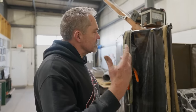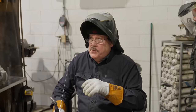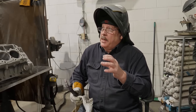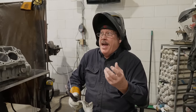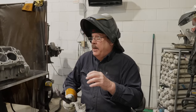It sounds like there's a lot more air going. Or is that the gas? No, that's the shielding gas. The shielding gas is causing the noise difference too because I run a helium mixture, so the sound is different. Okay, maybe that's why it's a little more piercing than straight argon would be. It does have a factor.